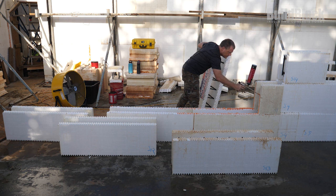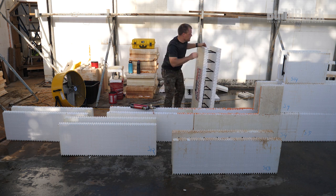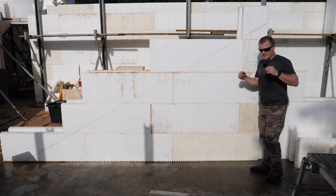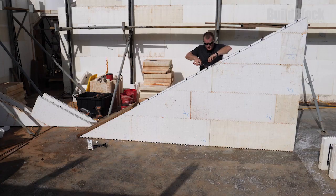Next, if you plan on lifting your gables into place, it can be helpful to glue the blocks together at this point. After you have measured your gables, set your chalk line. Now you're ready to make the cut. After you've made the cut, trim back any plastic that is peeking out above the foam. But try not to completely remove any of the webs, as this could damage the reinforcement of the block.